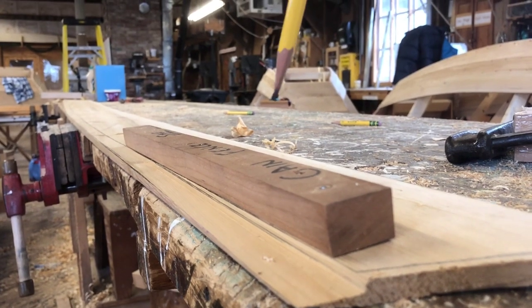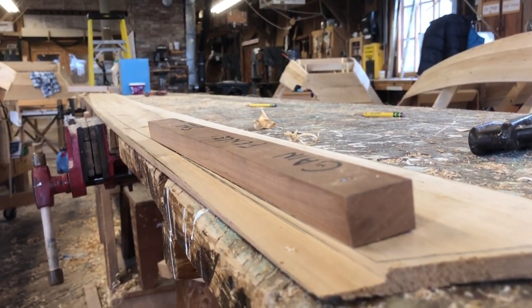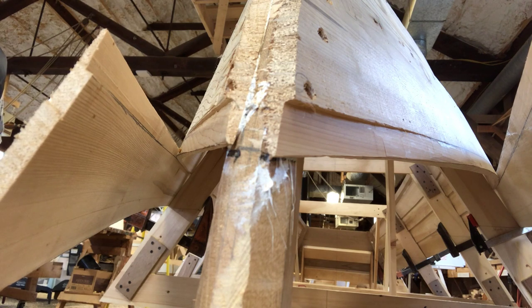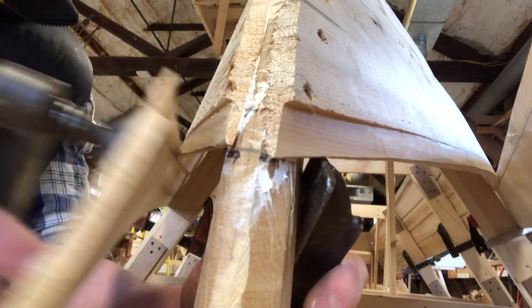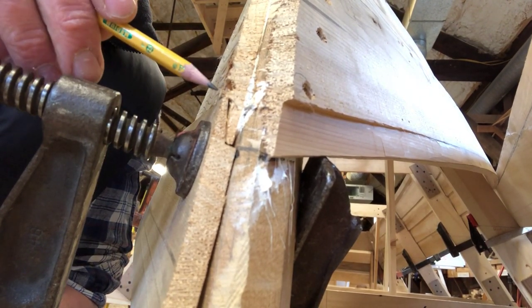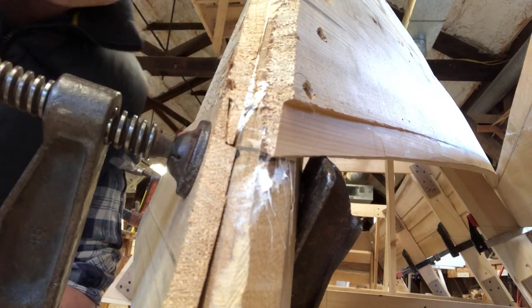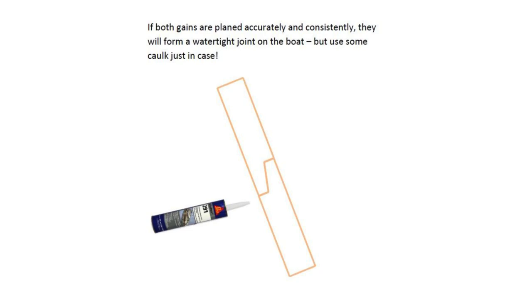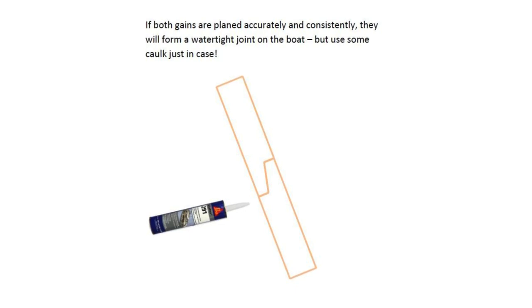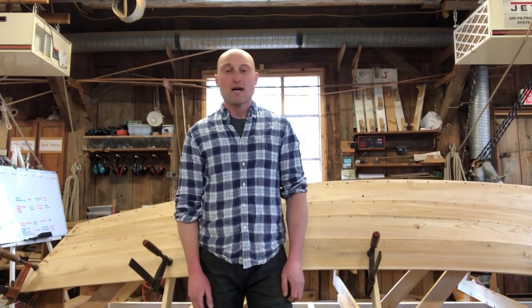One thing I didn't mention: you want to take a piece of wood and nail it down to serve as a fence. This keeps the plane at the right width and ensures that your gain is nice and even. The gain is cut and I've clamped the plank back on the boat. Now we're going to clamp it up at the stem and see how the gains fit. It looks pretty tight — there's a little gap right here but I think that will close up with a screw. If two matching gains are cut accurately and consistently, they will fit together tightly at the ends of the boat and keep the water out. It doesn't hurt to add a little boat-building caulk or at least a bit of varnish. Now that the gains are cut, sit back and watch as I install the planks.